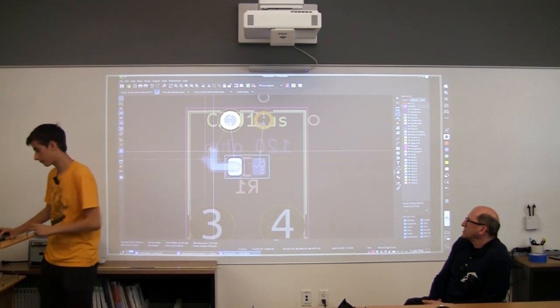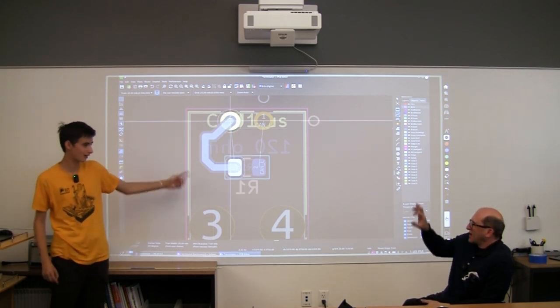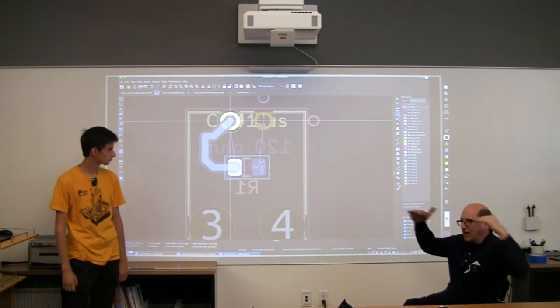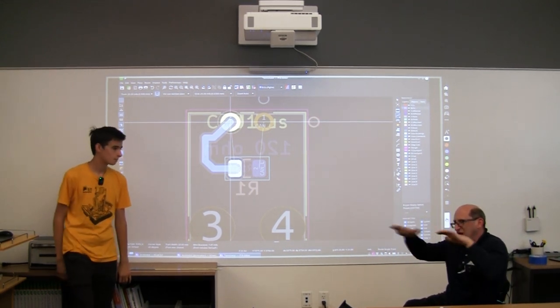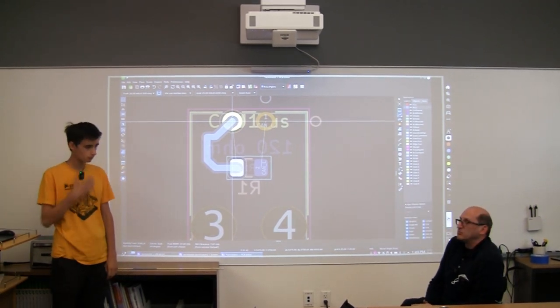So we can just keep going here. We want to keep it a little bit even. Sometimes it tries to make you do weird stuff like that. Take advantage of surface tension of the molten solder in order to align the part. So if you have it balanced, then when the solder's all molten, the component will be centered on the part if you bring the traces out from the middle of the part.